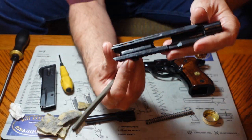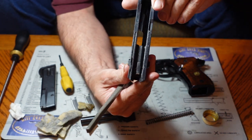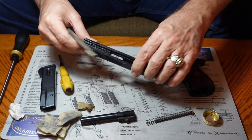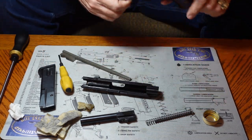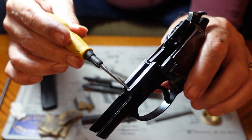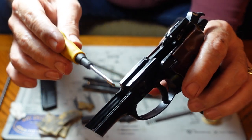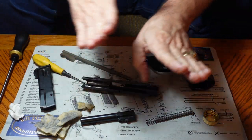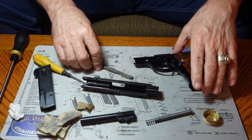There are a lot of little grooves and nooks and crannies in there that you have to get to. One thing to look for when we start to oil this gun are places where the metal is showing shiny spots. Right along the edges on both sides, we see a little bit of shine — that means two pieces of metal are rubbing against each other, and that's an area we really want to put some oil on.